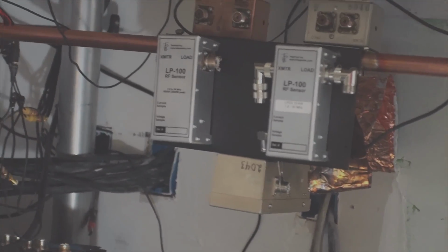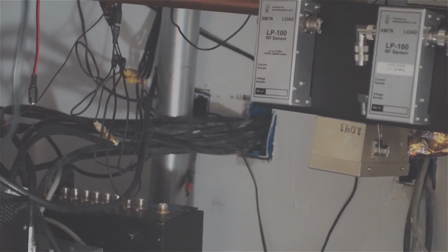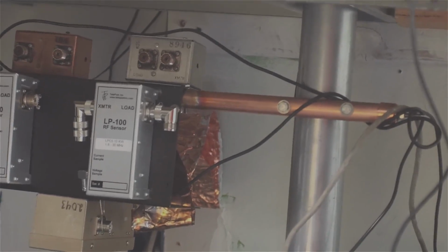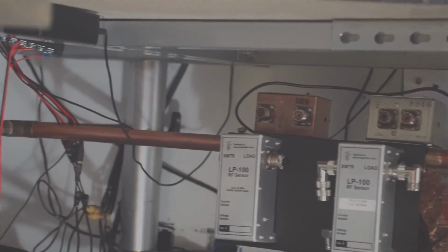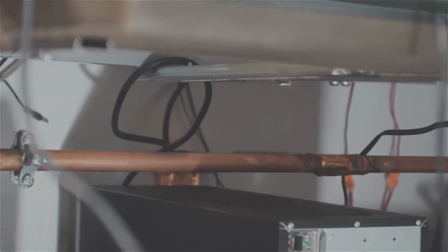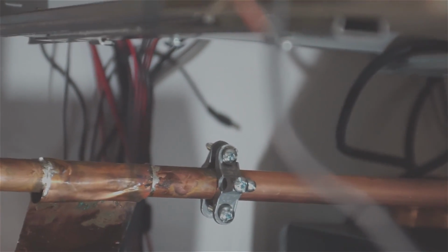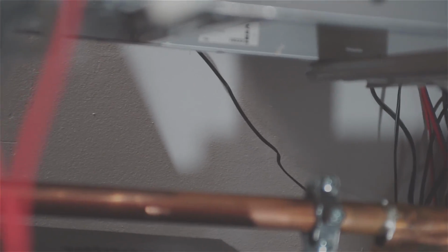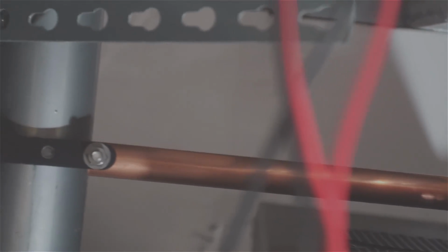Want to see what happens. What I'm going to do is an experiment, and that is to disconnect the grounding system and see if it really makes a difference. So I'm going to do it with it connected and disconnected, see if there's a change in the noise level. I suspect that there will not be. Again, the desk frame itself is steel, and there's a lot of it because it's supporting a lot of weight. It's from IKEA, and then this copper pipe is attached to the legs at those 3 places. All right, that's what's under the desk and what's on top of the desk.